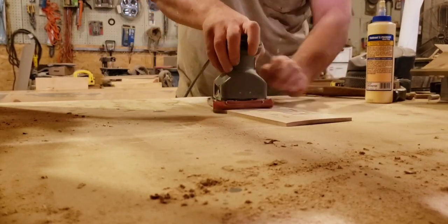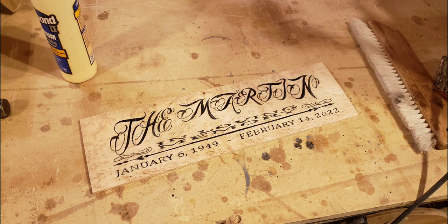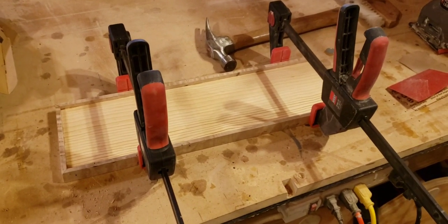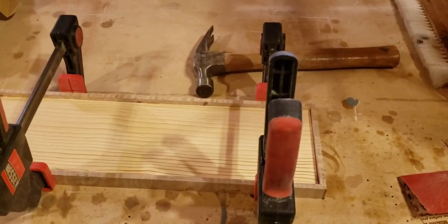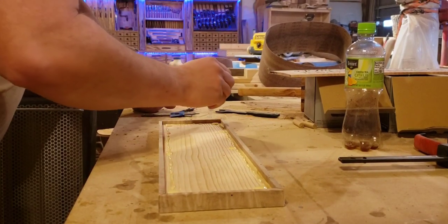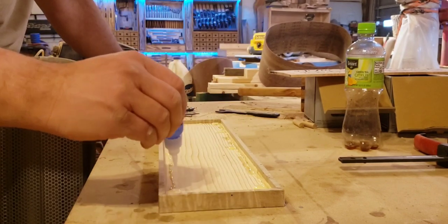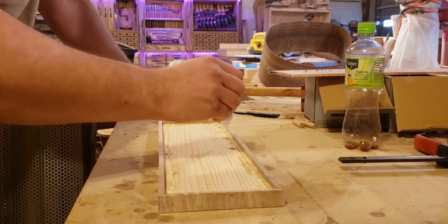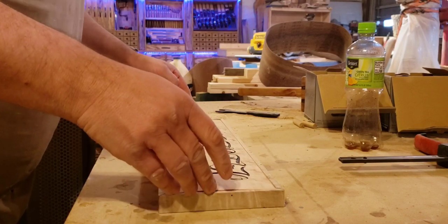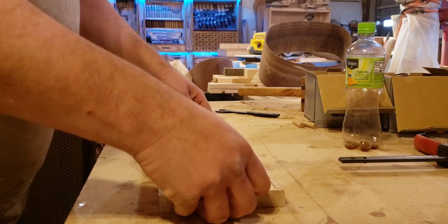Here I am sanding. I've gone in and painted the lettering, sanded all that off, and got it cleaned up. Here it is after painting. Here I am gluing up the plaque frame and stuff for the piece to sit into. I'll actually take wood glue, put it down, and then put some Loctite super glue in places. Within a minute or so, it gives it a really good bond and holds it securely enough where you don't have to clamp it — and it gives the wood glue time to cure fully as well. That's my little trick when I'm gluing things up.